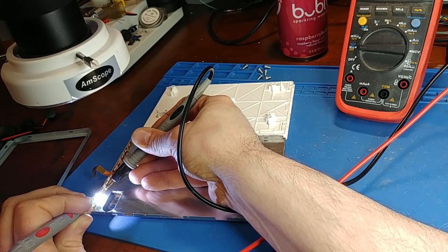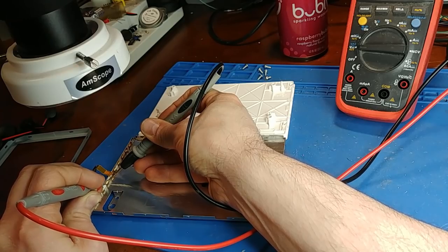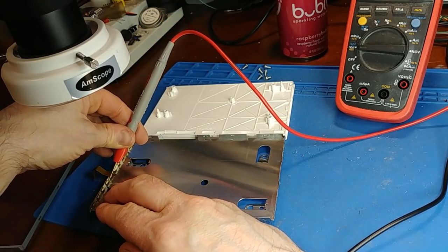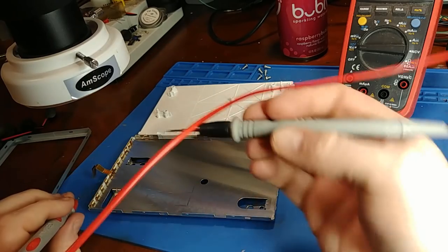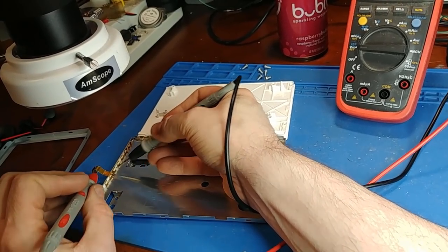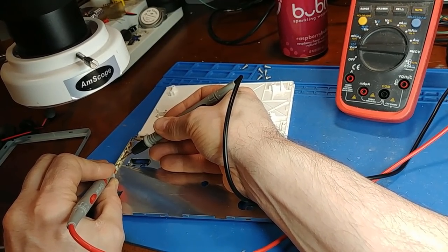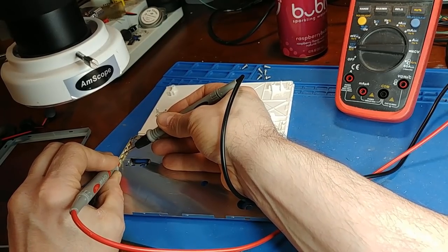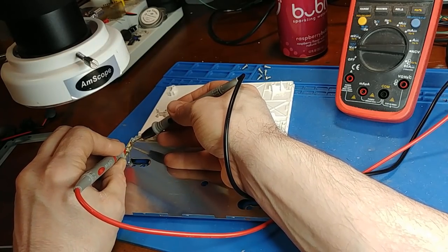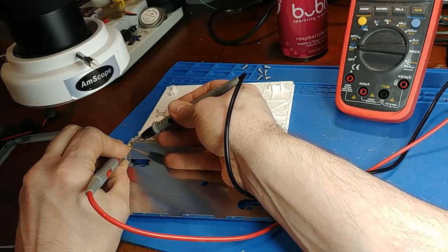The flickering is just my test lead connection. Another good LED, good LED — and this one here I can't get to light in either direction, so I think this was the culprit: it opened up and could no longer complete the circuit. I accidentally broke one other LED while peeling it apart, but the other nine seemed okay. Next I need to figure out how to replace all ten LEDs, which look a lot like laptop screen LEDs.